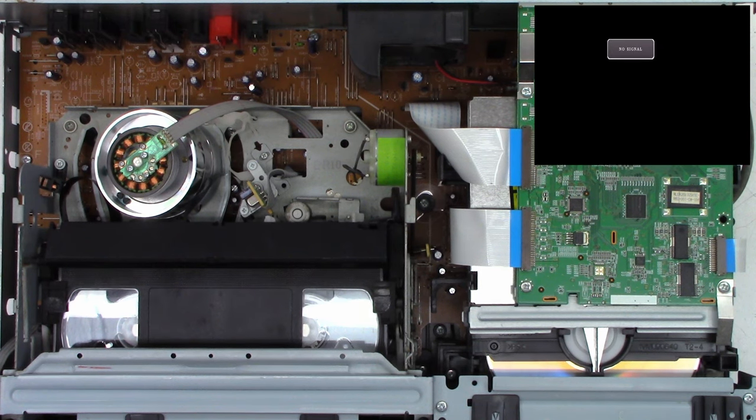You zoom in on it just a tad, but as you can see, it is very oxidized. So we're going to hit it with a stainless toothbrush and scrub it up, clean it with some acetone, and apply some more dielectric grease to it. One moment. Okay, hopefully the focus is adequate here. So I just want to go ahead and rough up all the contacts in this.